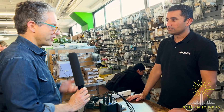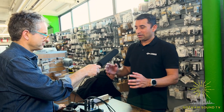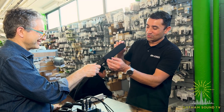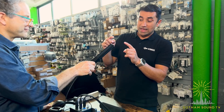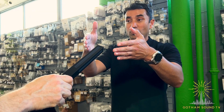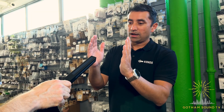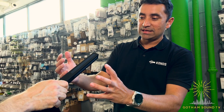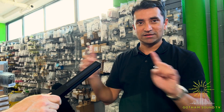So take us through what's special about this mic. The cool thing with it is — I'm going to just remove this little shield — you've got 80 elements here, so 20 elements each side. And what that does is form an end-fire array, super directional. But because it's got 80 microphones, what we can actually do is capture sound in 360 degrees around the microphone.